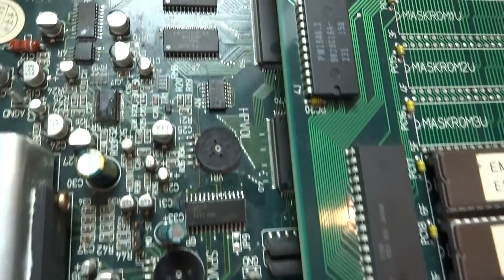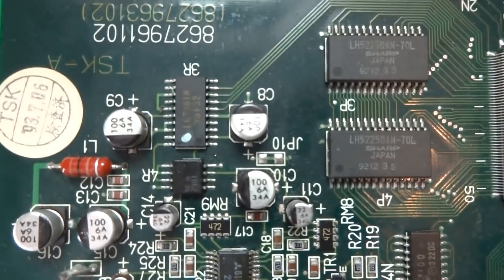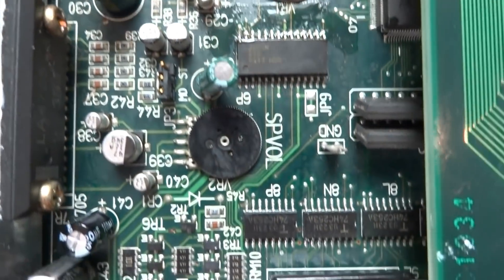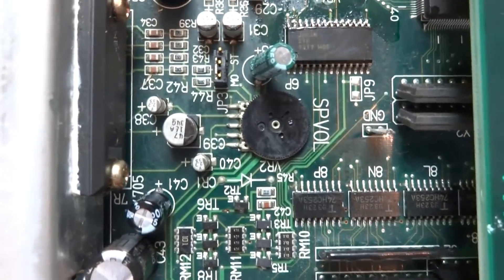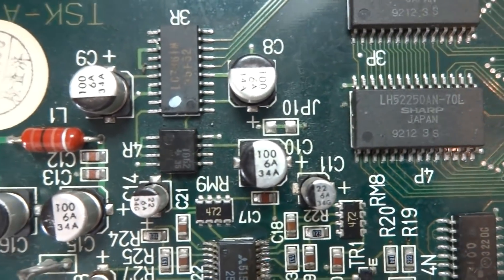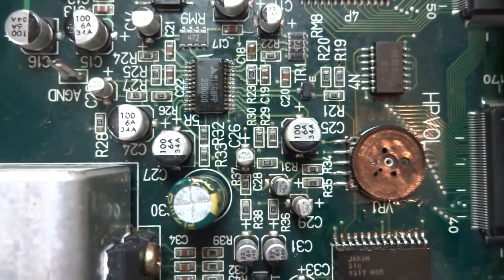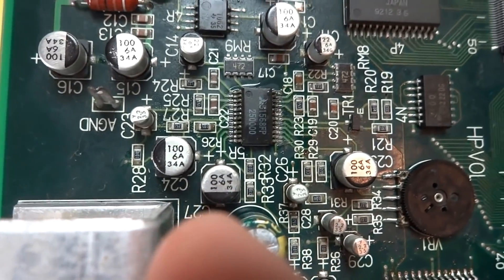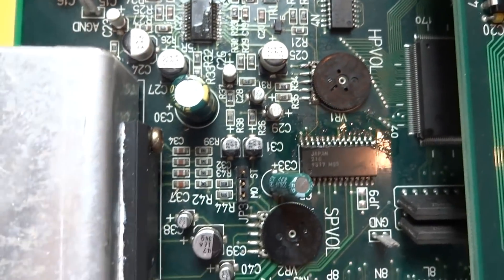What we're going to do is take these caps off in sets — anything that's a 100 microfarad, we'll remove all those at one time and put them on one at a time. I don't like to remove everything off the board at once because it can be dangerous. As you'll notice, in some cases it's tricky to see the plus and minus — if you can't see the positive and negative terminals it can be tricky, and you might accidentally put one in backwards, especially around this area here.